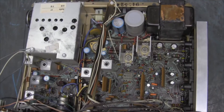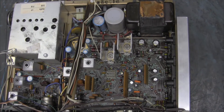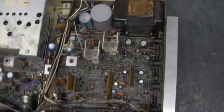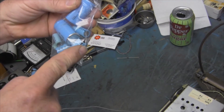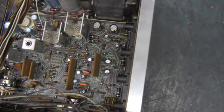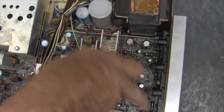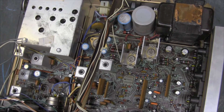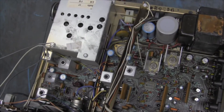I just knew when you re-soldered all the bad joints it'd be okay, because it usually is. Clean the switches and you're usually good to go. But these — you could rock them and one channel would cut in and out and make an awful noise, because the big ones are the output capacitors going to the speaker, so you can imagine the thump you get when those would open. And there were some smaller coupling caps over here — they made an awful noise too. If you look at it and you don't see burned resistors or any sign of damage, you don't really have a blown channel — it's got to be something else: switches usually, and coupling caps usually. In this case it was coupling caps.